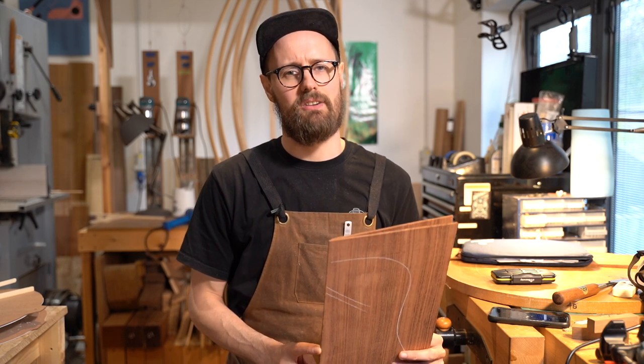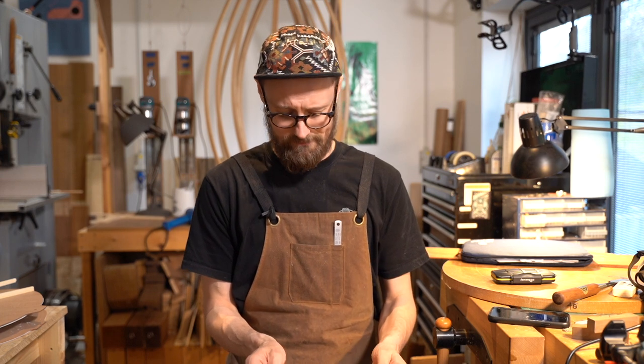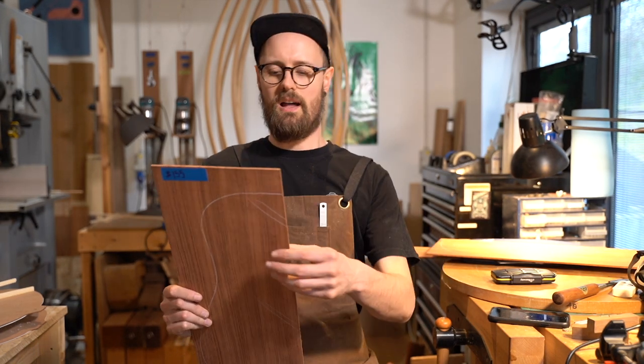This is a really nice straight-grained set with some nice color variation. If you go to many trendy office buildings, quite often they'll have a boardroom table made out of a giant slab of Bubinga. At a hardwood specialist they'll have huge live-edge, waney-edged boards of Bubinga advertised as tabletops with eye-watering price tags. Bubinga is very hard and very dense — 2,410 on the Janka scale, similar to Indian ebony and Indian rosewood. It has a specific gravity of 0.89 and an average dried weight of 890 kilograms per cubic meter, so it's heavy. It does however have an exceptional strength-to-weight ratio.